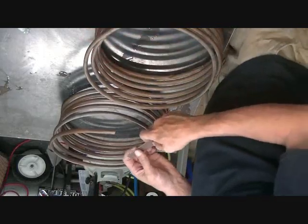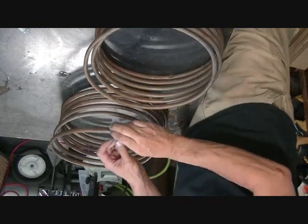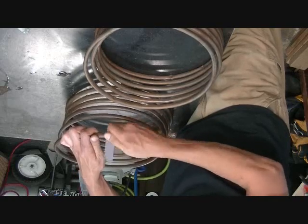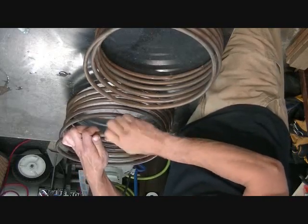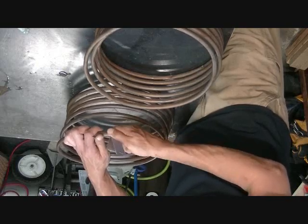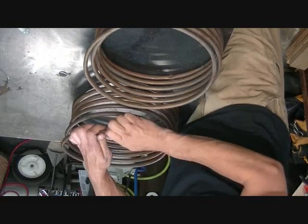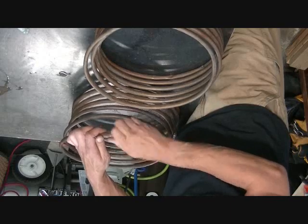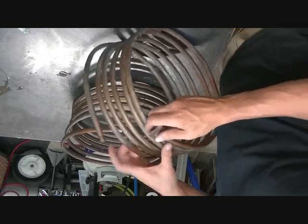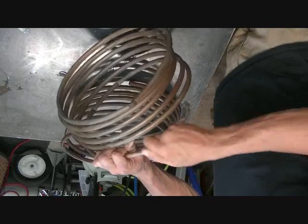Next, we're going to want to clean the outside of the pipe with a little bit of sand cloth, or usually use emery cloth. This is 120 grit sand cloth. What you want to do is take off all the oxides of the copper. That's why the copper turns color, goes dark. It's called a patina. It starts patinaing, oxidizing, and that's what gives its color. Here, nice and clean. Good. The other side that I already previously cut, go there and give it a nice clean up.